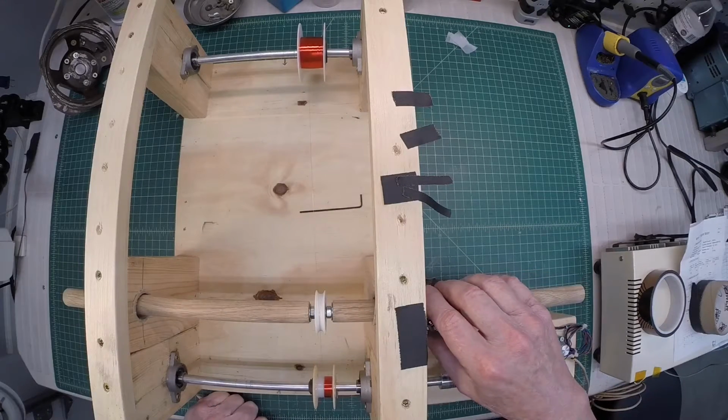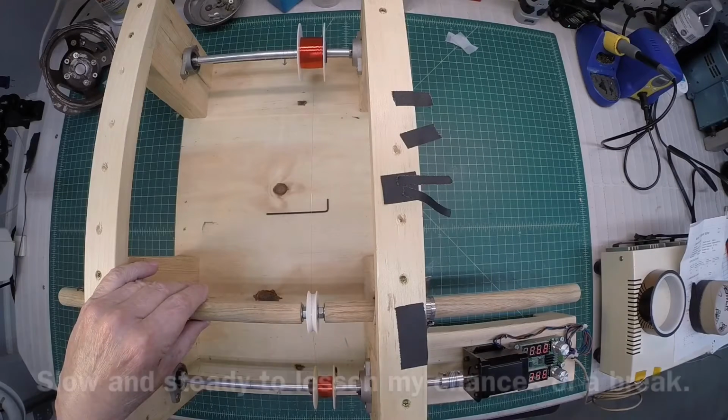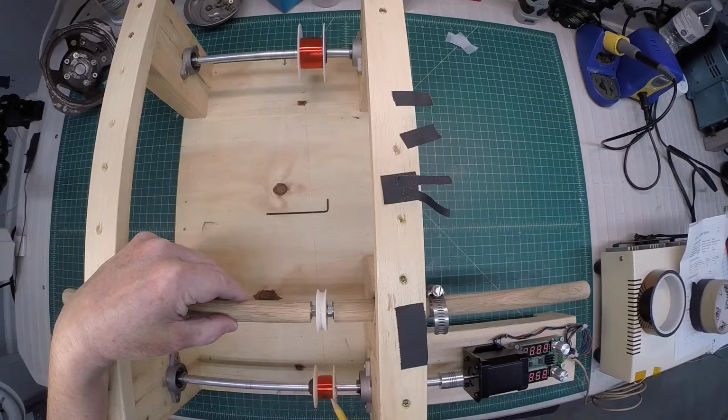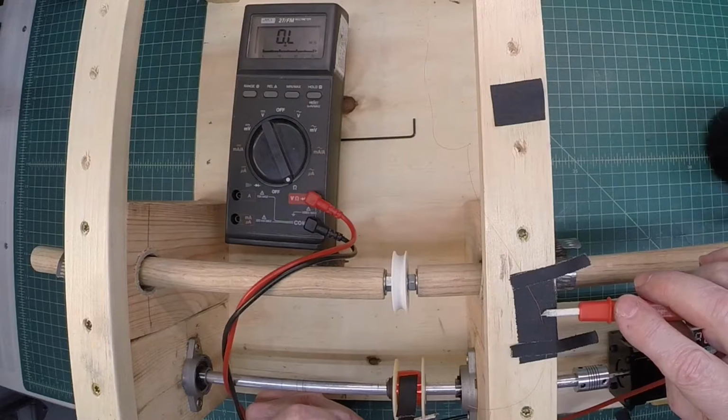You can see it's almost feeding itself on the bobbin, doing a really nice job laying down. We're not on cruising speed yet, but you can see I've cranked the RPMs up here. I'm just north of 100 RPMs. As you can see here, things are still progressing, so maybe in about another 10-15 minutes or so of winding, I'll go ahead and check the DC resistance, see where we're at with the coil. Let's check the DC resistance here.